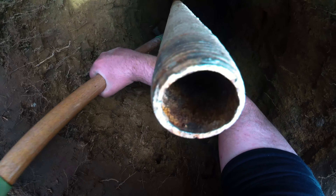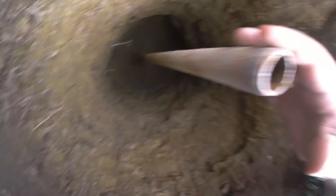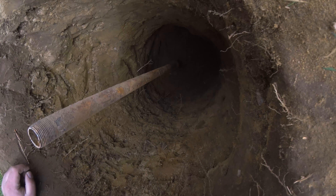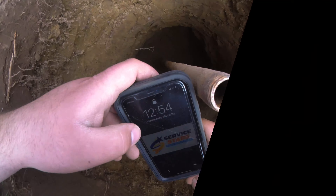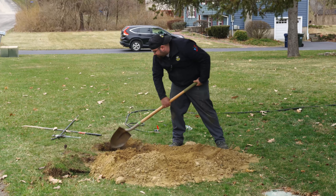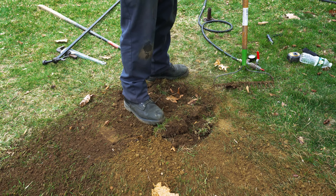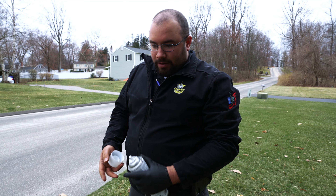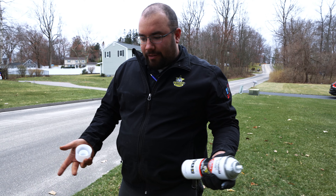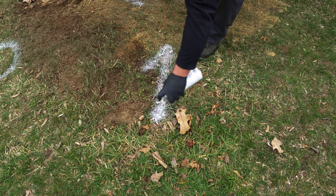This just turned into more than I was hoping for. What happened is the curb valve is full of dirt. We dug it all up, couldn't get the curb box off — it's locked onto there. We were told that with that style of valve there's an issue where they rust together and you can't get them off. So at this point it's beneficial just to replace the valve. I'm marking out for a call before you dig right now, and we'll come back out, dig it up, replace the valve, and then continue on with the work inside.